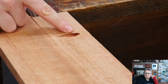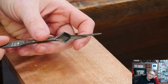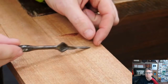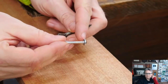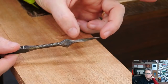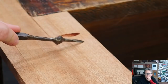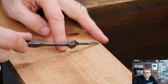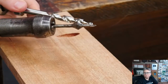How is pocket hole joinery done historically? It was done with something like this — essentially a Kreg jig but just the cutter itself, with no jig. It drills out the hole and has a conical shape head rather than a flat shoulder like the Kreg jig, so you put in a regular flat head screw. Notably, there's a much longer distance from the tip back to the shoulder, which allows much greater material between the edge of your board and the hole. So rather than drilling right up at the edge, you start drilling further back and run all the way in.